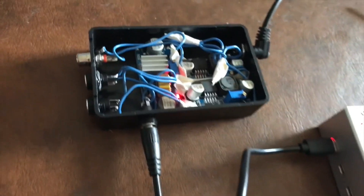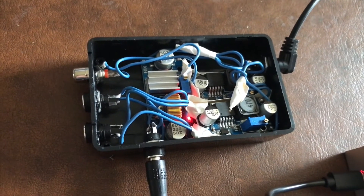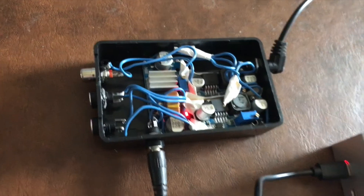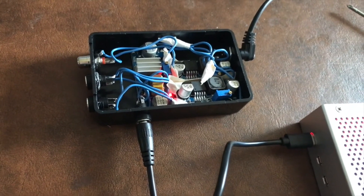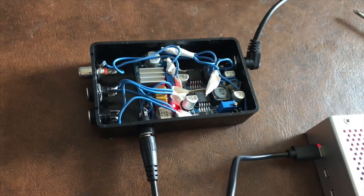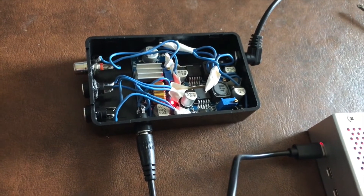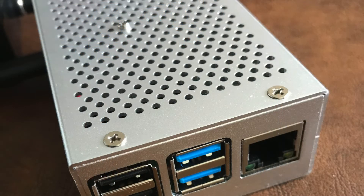This is a very basic, cheap version of the astro power boxes you see for sale. I love my Pocket Power Box from Pegasus Astro, but it doesn't have 5 volts out. They opted for a very popular configuration with four 12 volt DC lines and one 8 volt line for powering DSLRs, so I understand why they designed it this way. With Pegasus you get full ASCOM and INDI support for switching lines on and off, and temperature and humidity sensor driven dew control. It's powerful stuff.